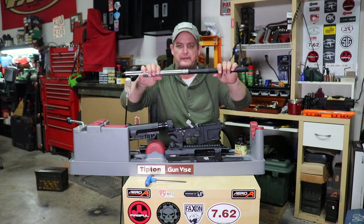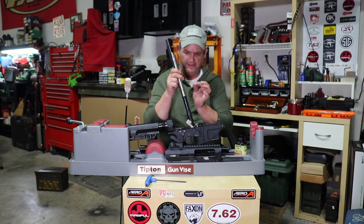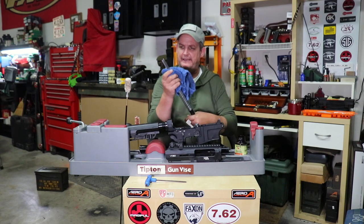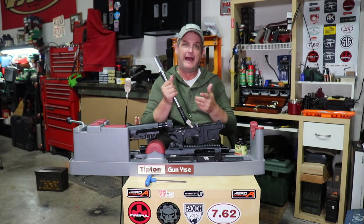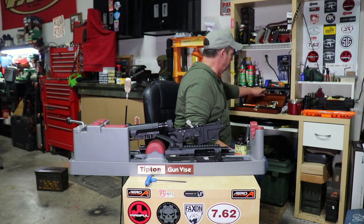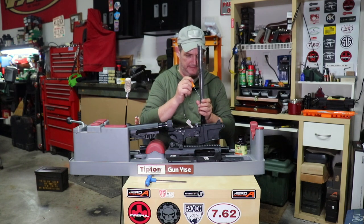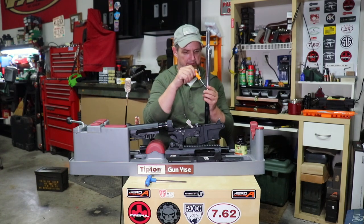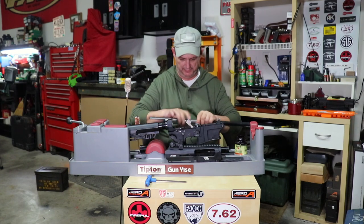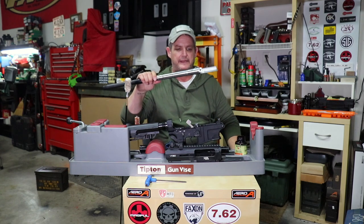Brush away from you - it'll spray on you otherwise. If you're wearing good clothes, be careful. You may want to wear rubber gloves if you don't want solvent on your hands. Just like that, even that heavy carbon is now gone. Wipe this down - clean like the day it was made. Make sure there's no residual gunk left in those ports. You can take a little feeler gauge wire, a pick, or anything you have and look with a light from the inside to make sure they're clean. Even a little blockage on those ports can make a huge difference in these box-magazine-fed guns.